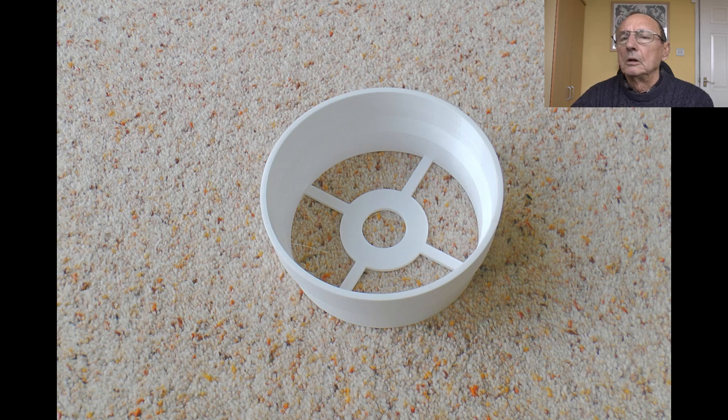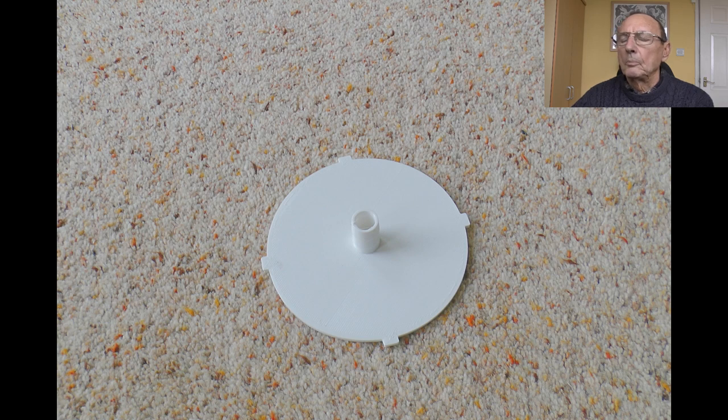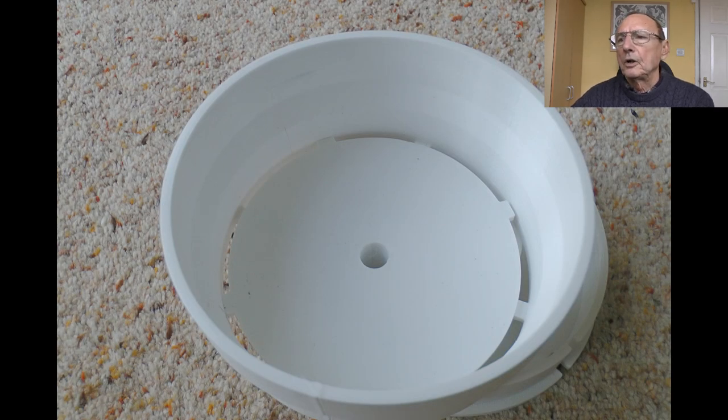The top cap starts with a piece that goes on the last pot-holder, then there's a second piece that's actually upside down — the tube from the pump fits onto a spigot sticking up. It sits inside with four little spacers leaving about a 3mm gap all the way around, so water comes up through the middle, spills over the top of the plate, and trickles down the edges — keeping it running down the inside of the tower and not just down the middle, missing the plant roots.